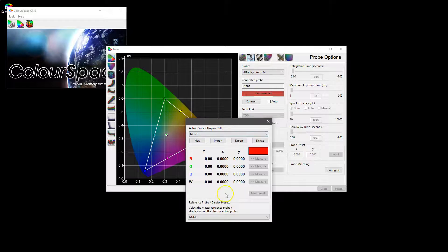The display is important because different spectral responses do produce different results in the probes, so you need to match on the same display for the best accuracy. One thing that's very important with ColourSpace is that you don't need to do probe matching in advance of actually profiling a display, because probe matching is actually retrospective, which is very unique. I don't think this is something that any other system is able to do.